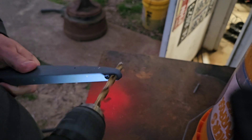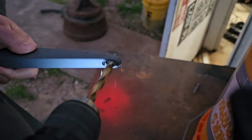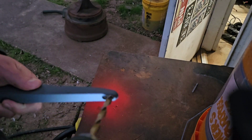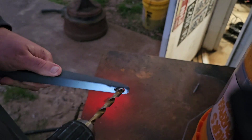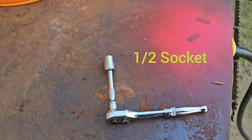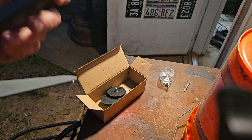I had to enlarge the holes on each end of the Starlink mounting stand. You want to enlarge the hole as far out to the tip as possible. The last thing you'll need is a half-inch wrench or a half-inch socket — I used the socket.